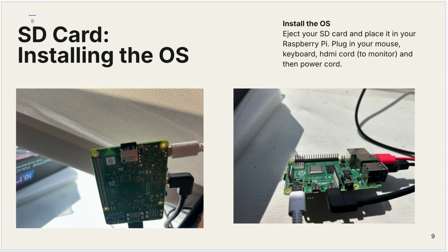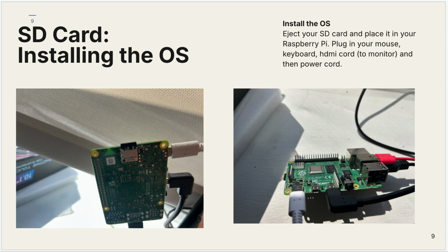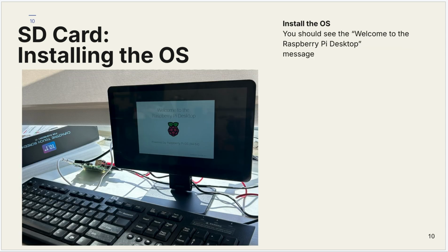So in the next video, I'm going to show you how you can hook your Raspberry Pi to your monitor, and at that point you'll put the SD card into the SD card reader that is attached to the Raspberry Pi. You'll hook it up to the monitor and give it power, and then you'll get this welcome screen. I'll go over this process for using the monitor that I have. The one that you have should be almost identical process if you choose to get a different one. And I'll step you through how to configure the OS. So that'll be part 2, and then part 3, I'll go over how we can create the interface for the kiosk itself.